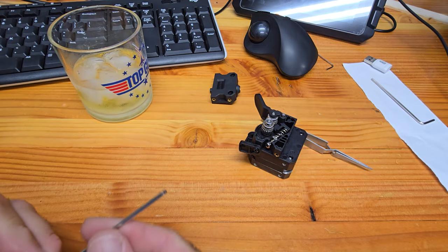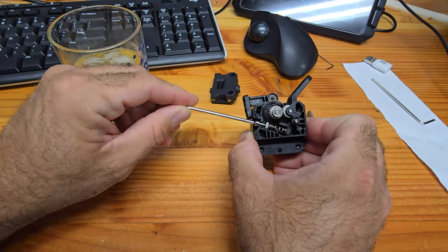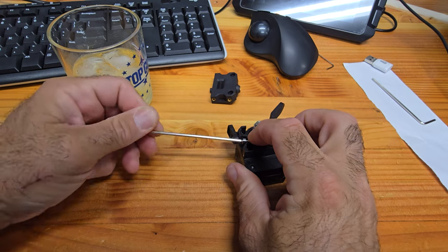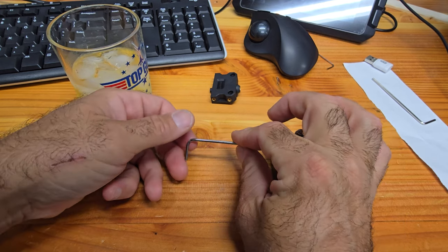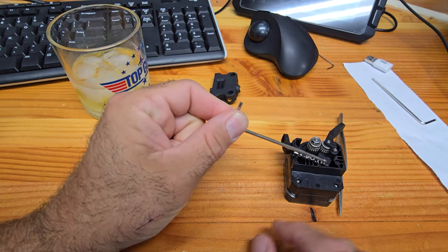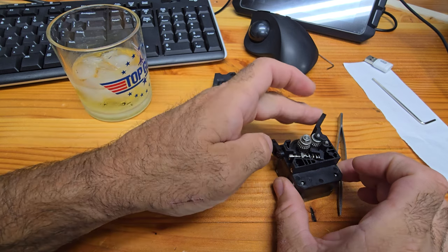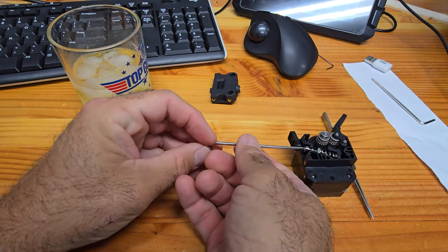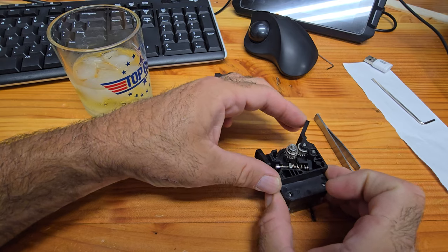So I'm going to do it here. To increase tension, we're going to turn clockwise — and as you can see, that pushes the nut down, increasing pressure on the spring. It feels like there's a little bit of tension there, and we can keep going more and more. But if we do too much, it's going to come off the end of that bolt in there. So that's pretty good.